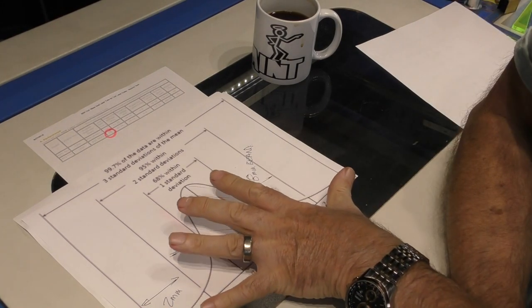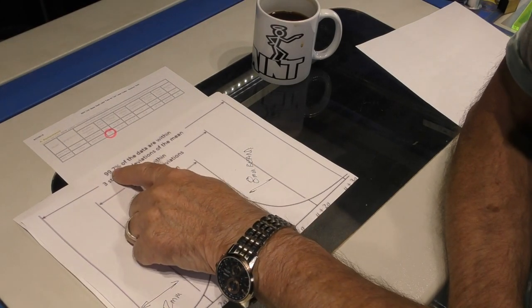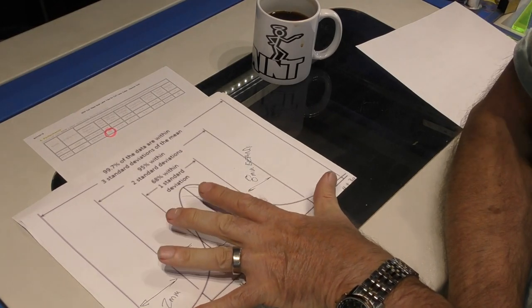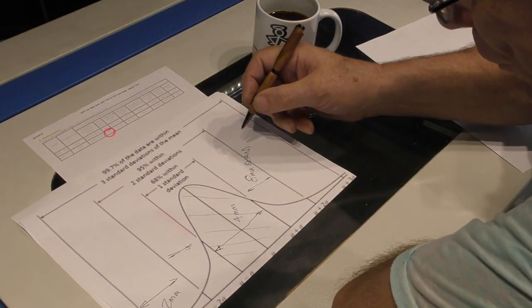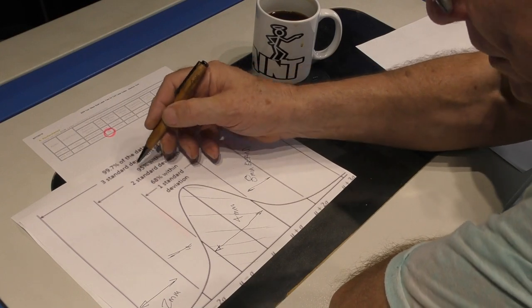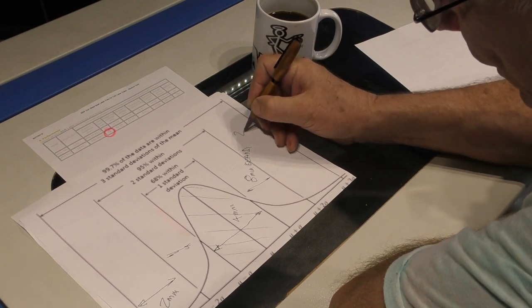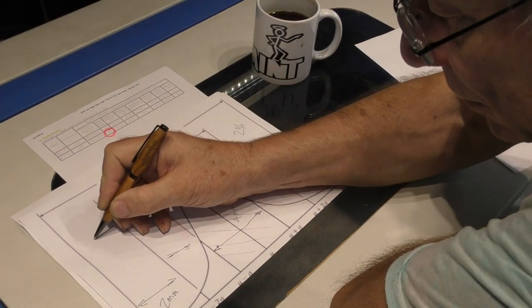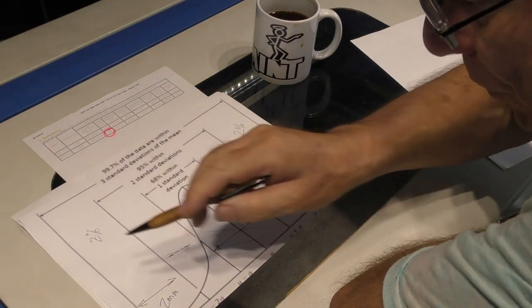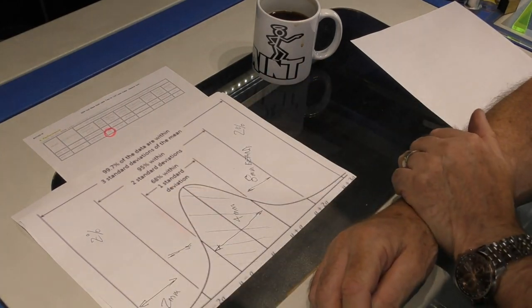And it's not until we get to the full 12 millimeters that within a smidge, 99.7%, we've collected all the available power. If we look at it another way, all we've got left here, this is 95%. In fact, it's more than 95%. It's nearly 96%. So what we're left with here is 2% of the power in this remaining 4 millimeters of diameter.